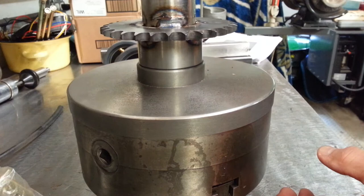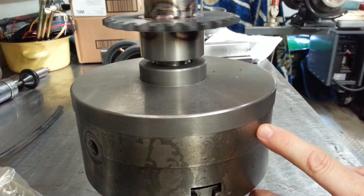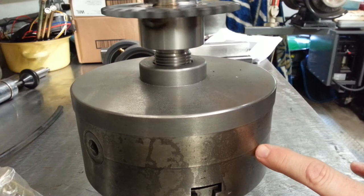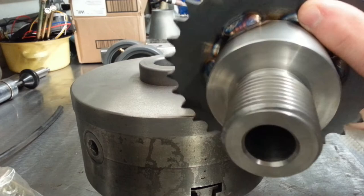This is what's going to be turning everything — of course it'll be right-side up. I have about three thousandths run-out here, which isn't bad. I want to make sure everything is as square and with as little run-out as possible. This sprocket does have a little more run-out; it must have warped a little when I welded it. I tack-welded it in four places — I didn't go all the way around to try to prevent warping.